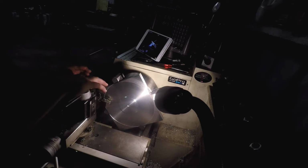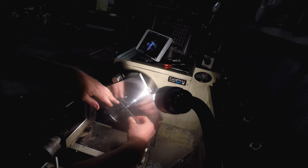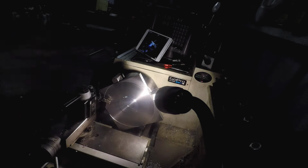The thing is, I had to have that thing kicked around, remember? So now I've got a taper, but I still have a little extra stock here. I'm going to try to see if I can just barely touch that and blend that in. I just can't, with this small of a lathe, quite seem to get it in there. Yeah, I'm at about 3 inches, and remember we needed about 2.950, so we got about 50 thousandths to play with.